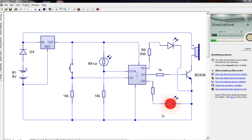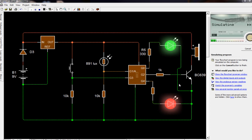The alarm's not completely dark in the drawer, but it's quite dark. That is now solid on — my alarm is armed, my drawer's shut. But wait, there's a thief coming in, and they want to steal my chocolate. They open the drawer, the level of light shoots up, and now the alarm goes off. It's not making sound in the simulation, but believe me it would. You'll see the transistor switching — is flowing, not flowing, is flowing — and that would be going beep, beep right now — so the alarm's going off.